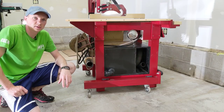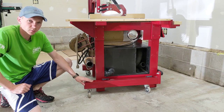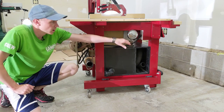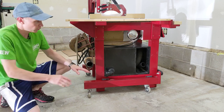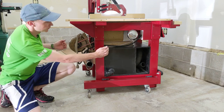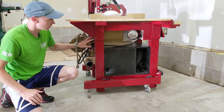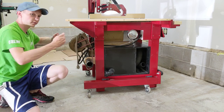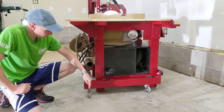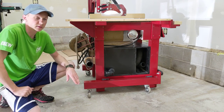This is actually the second caster system I built for this table saw because on the first one I overlooked a major issue. On the first set I made, I made these wheel supports only as wide as the actual legs on this table saw, meaning each caster was about under each leg. When I went to operate it the first time, the whole back end kind of squatted and wouldn't want to pick up off the ground. I realized that the majority of the weight sits more on the back half of the cabinet, and the motor hangs out the back, which puts the center of gravity even further towards the back. So I had to rebuild these supports wider so I could get one of these wheels back further to help distribute the load better and get a more even lift force out of these wheels.